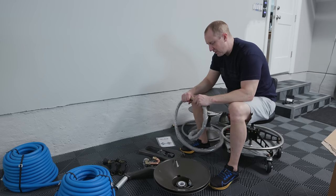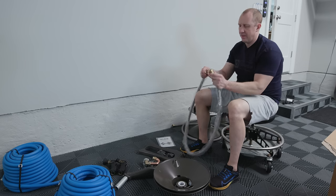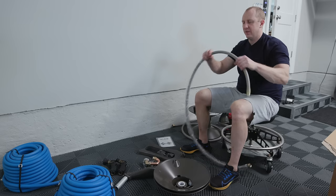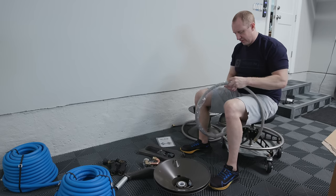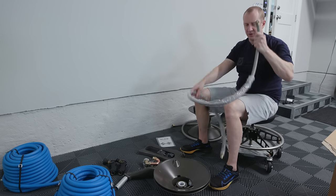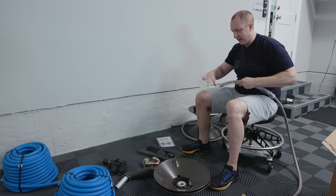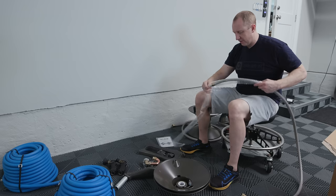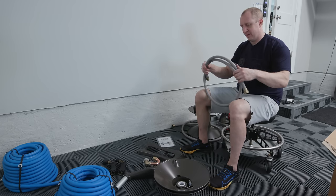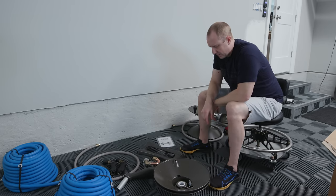So this is the inlet hose. These hoses are great — they're poly hoses and they have the best termination in the game. The terminal couplings they use on their hoses are amazing. These were the original inlet hoses. I'll share why I prefer a different hose for the main hose reel. You could buy the Ely poly hose, but I like this Continental hose much more. Back in the day I sourced a three-quarter inch Continental hose thinking it would flow better, until I eventually realized we don't need extra flow and a five-eighths hose is plenty.